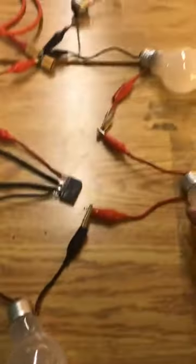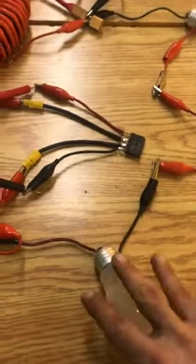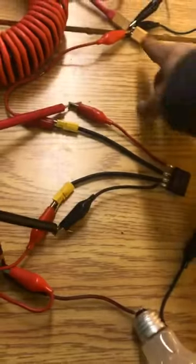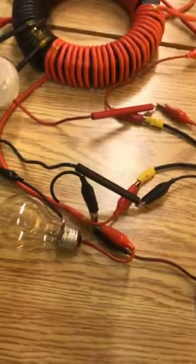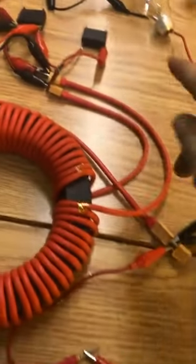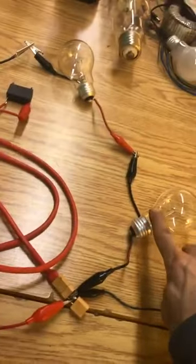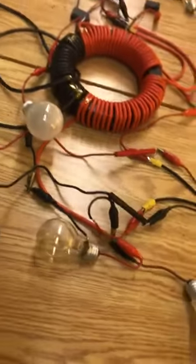500 watts, 500 volts across here, split between three bulbs so I don't blow up the bulbs. I simplified and expanded this so it can easily be understood. I've hooked up the feedbacks that take the output back into the resonator — this is one feed here with two bulbs on it, and the other feed is over here with two bulbs on it.